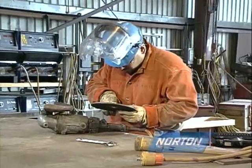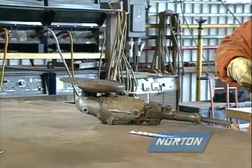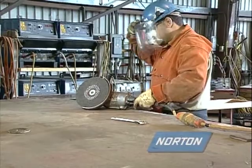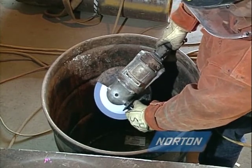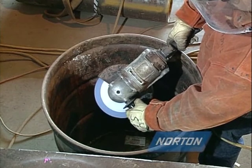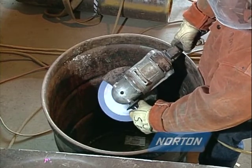Check the wheel speed and the machine speed. Make sure the flanges are clean and in good condition. Once the grinding wheel is mounted, reconnect the machine. Adjust the guard if necessary, place it in an enclosed area, and allow it to run for one full minute. If the wheel was damaged in transportation or handling, it will most likely break in the enclosed area.